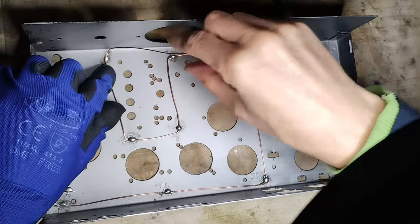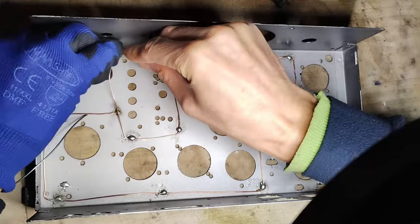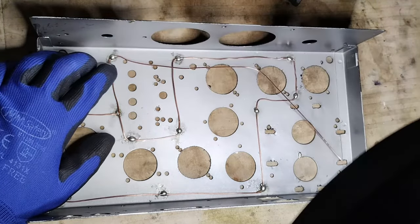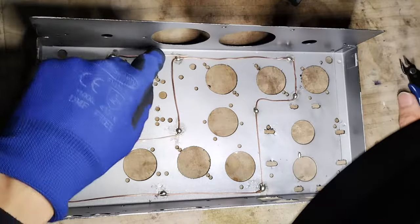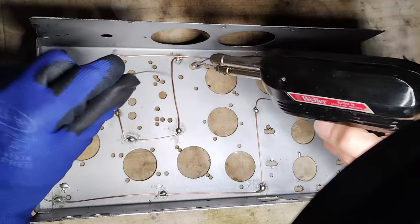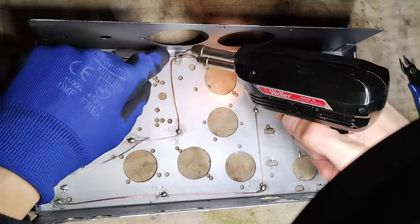The alloy containing bismuth would work well only on properly galvanized iron, because the zinc ductility would compensate for the rigidity of the solder points. After the zinc paint, one might want to put a different color on top of the chassis, but if this is the case, the additional paint should be applied after having prepared the ground copper network. This is necessary because the paint would not stand the temperature while soldering directly on the chassis, and it would get ruined, requiring an additional application.